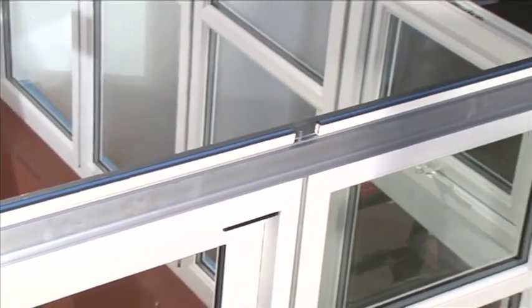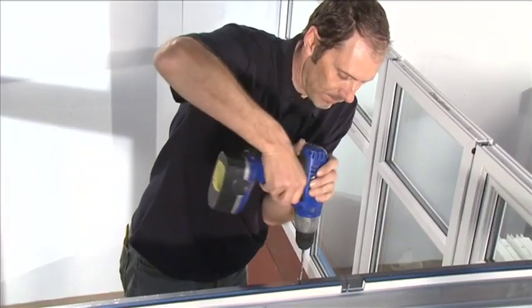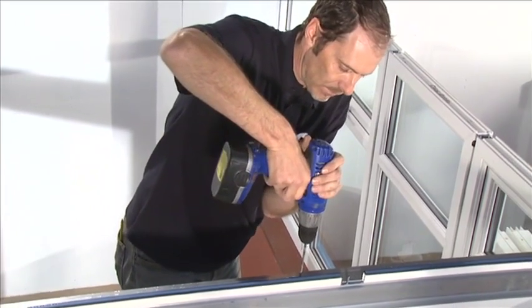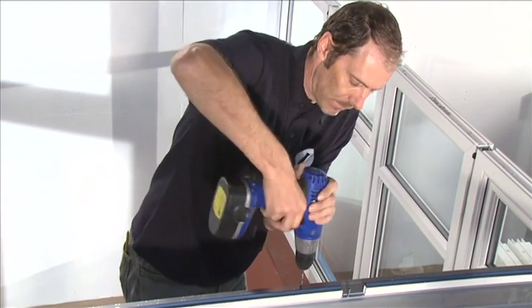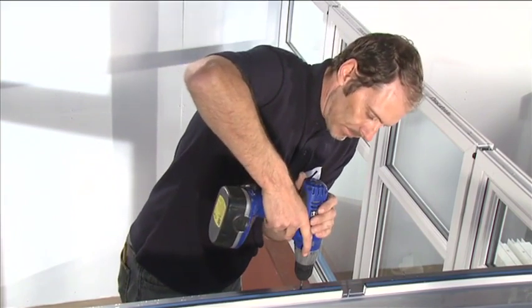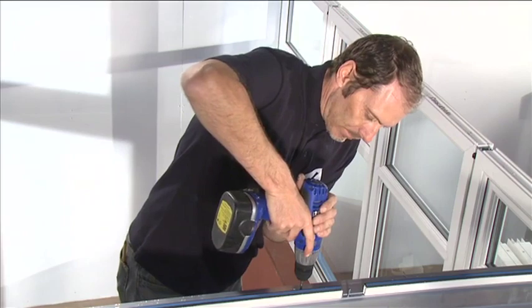The inside face of the overhang will sit against the front face of the panels and the end of the eaves beam will be flush with the outer face of the side panels. Once assembled on top of the panels, drill through the eaves beam only using a long reach 5mm drill, 100mm from the edge of each window.